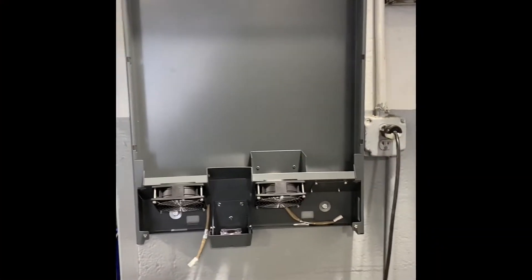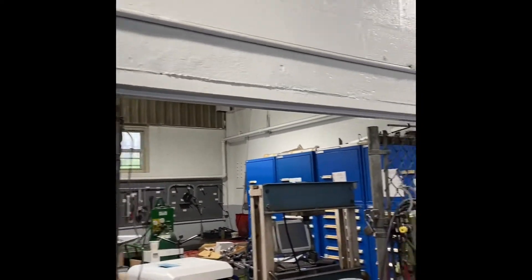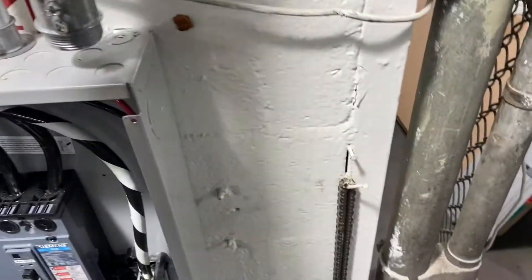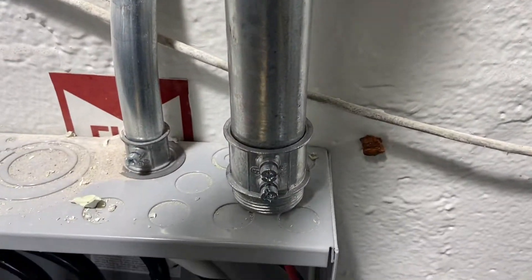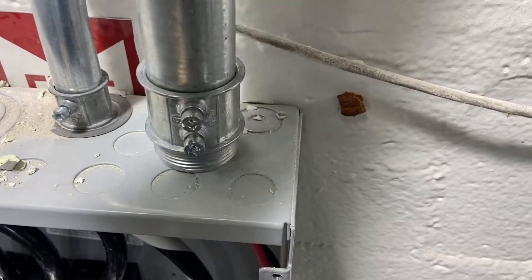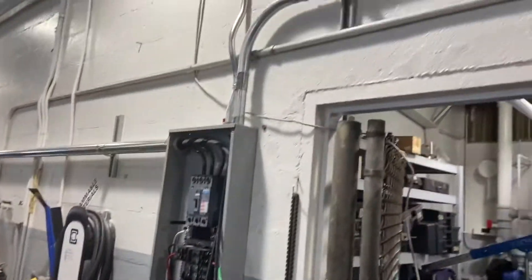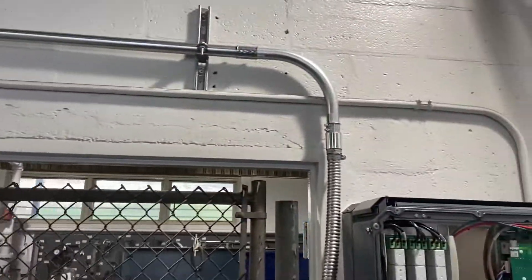Now we have the casing connected. Got some versa bars, running a conduit pipe coming down into the electrical panel. Now we're going to run the conduit up to the top. So we got this inch-and-a-quarter pipe going along this wall. Checking my position and removing the middle knockout, then enlarging the hole to an inch and a quarter. Now we ran the inch-and-a-quarter pipe down to greenfield.